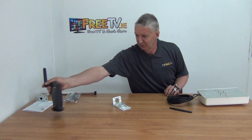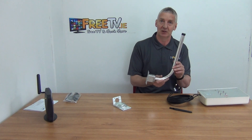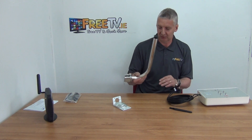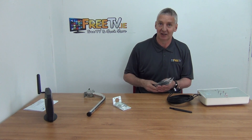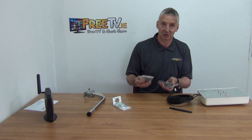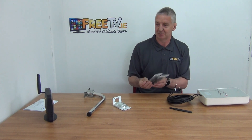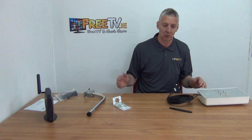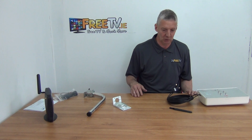What are the options we offer? Well, the first thing is you can buy the bracket mounted directly on — by default it's not included, but you can click and add it. That's a separate product we add in with the kit. You can also get extensions and go with an extra five meters, giving you various lengths of SMA extension cables. Keep in mind the longer the cable the more potential for signal loss, but overall the 10 or extended 15 meter won't be that significant in terms of overall loss.